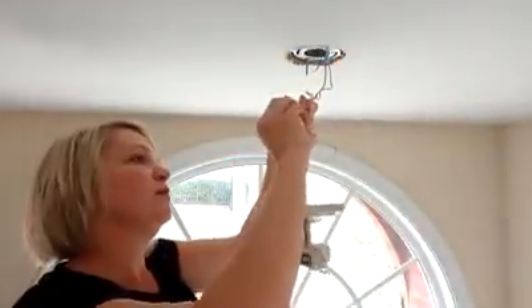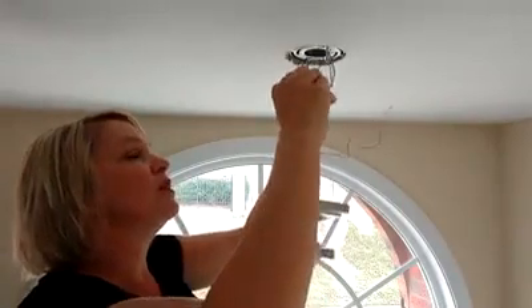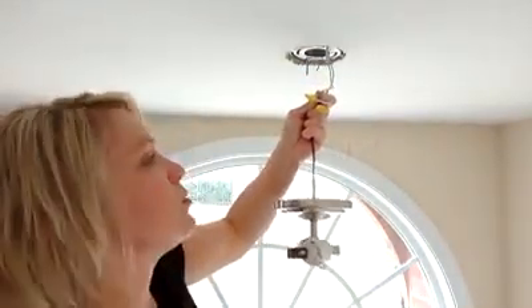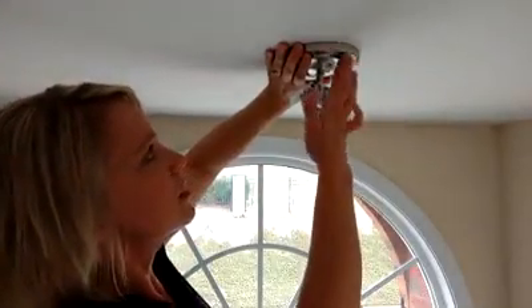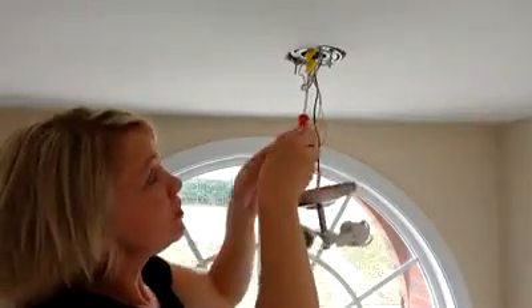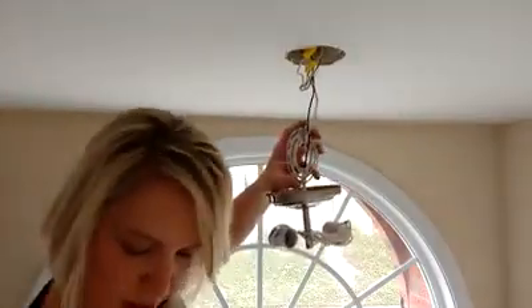Back to the story. Cover the wires with one of these electrical caps — those are to make sure they're well insulated and stay connected to each other. You definitely want to use those; don't skip that part. I had a few minor mishaps while finishing off the installation. The screws in the ceiling plate from the old fixture were too short to reach the new fixture, so I had to take down the ceiling plate and change it.